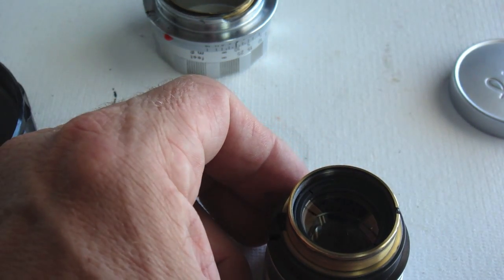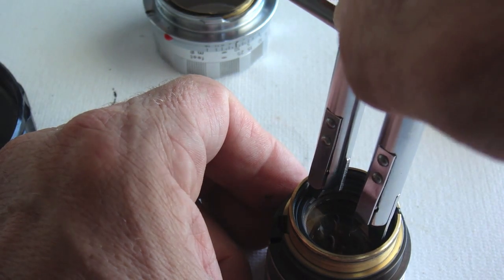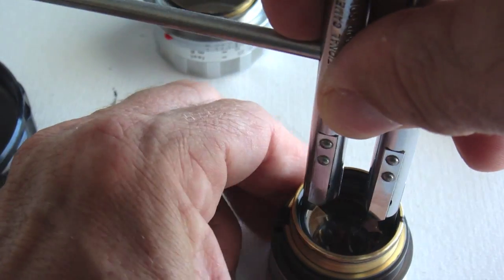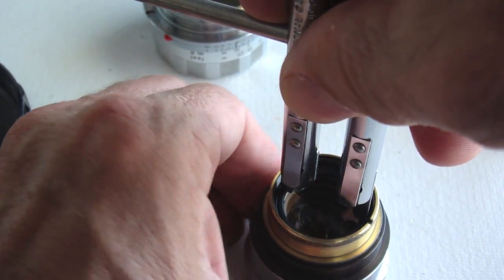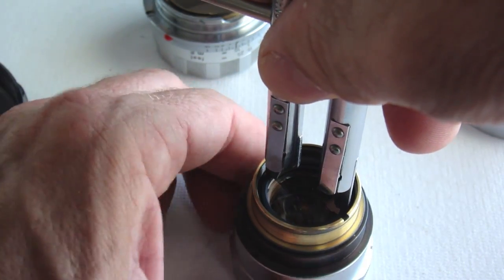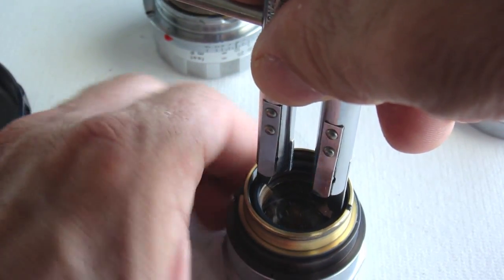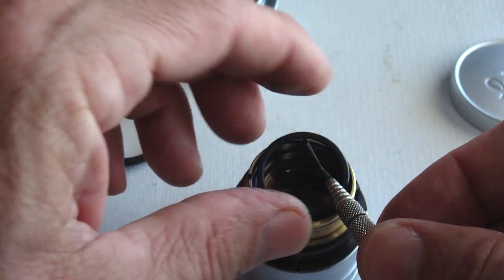We will begin disassembling the lens group by removing another spanner ring. Applications like this one are where the use of an adjustable spanner wrench is very nice. No fussing about trying to adapt something or come up with your own DIY spanner wrench. Once the retainer ring is completely loose, you can lift it free with the aid of a slotted screwdriver.